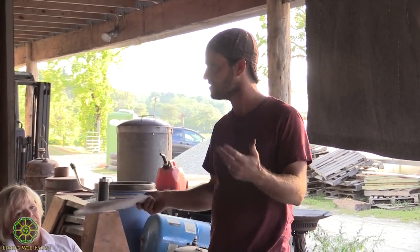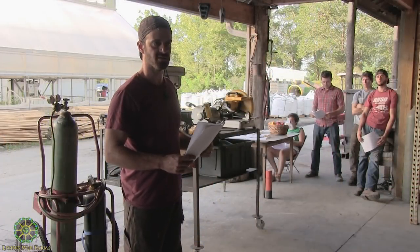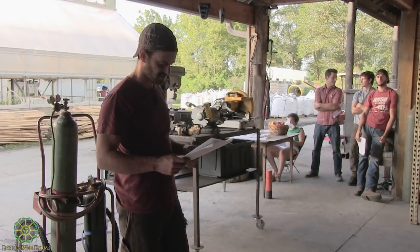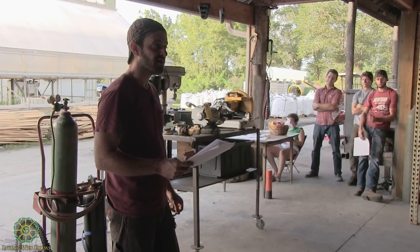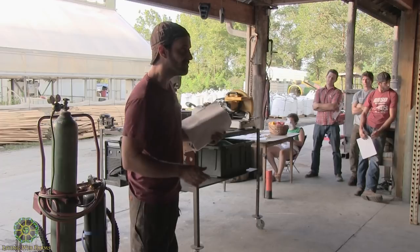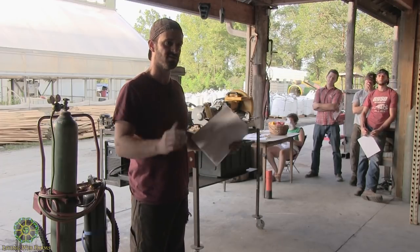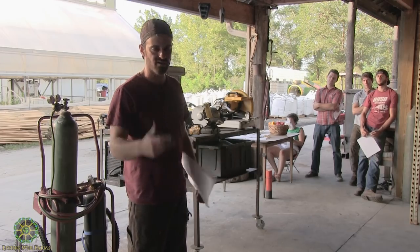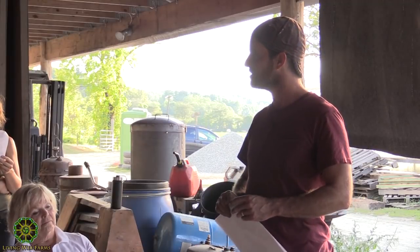Eyes, again, obviously, protect your eyes. You don't even walk around here when somebody's doing any welding without protecting your eyes. Gases, off gases: when you're heating the steel, when you're welding, gases are being created. Ventilate, get some air movement of some sort, or wear a really nice respirator.